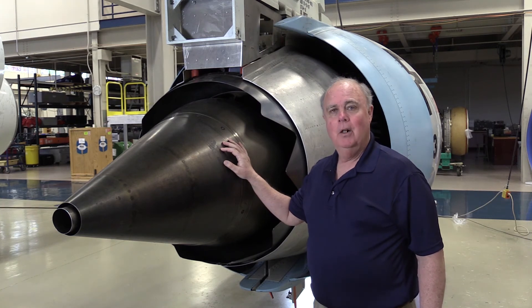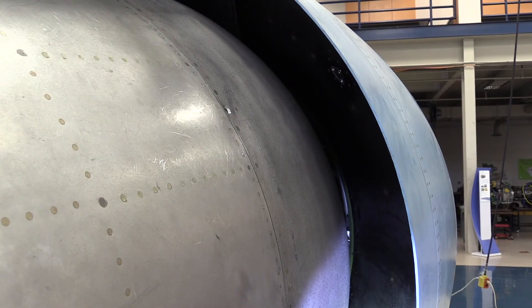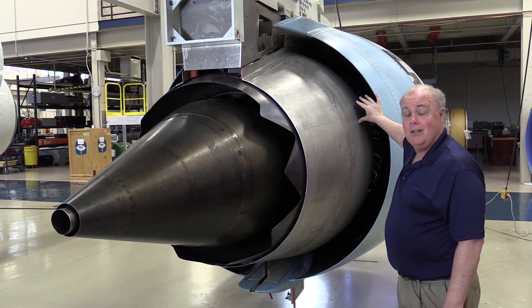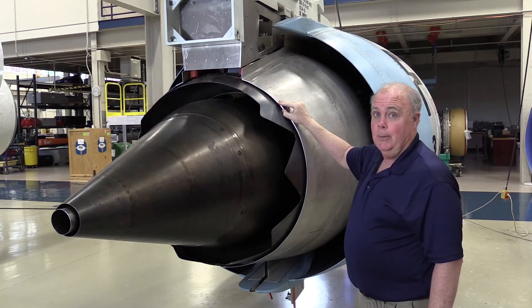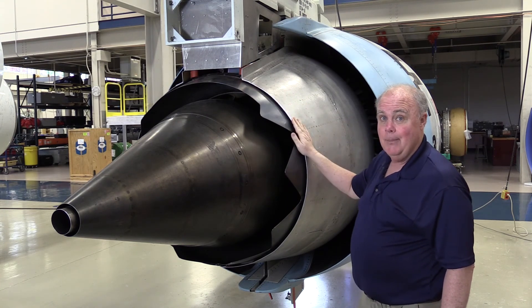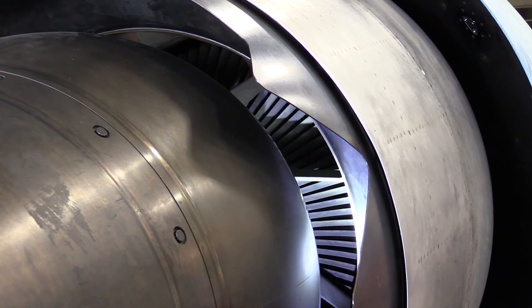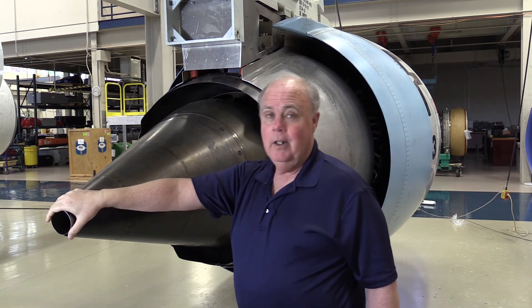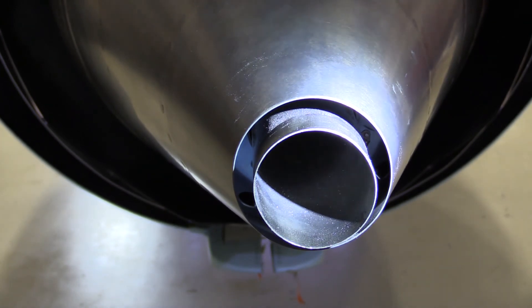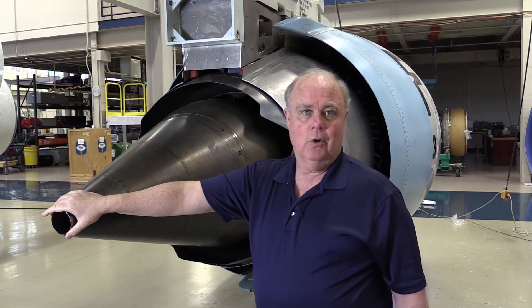Once we cover the engine — which we'll show you in more detail — we're going to go to the aft end and show you how we cover that. Now we're at the aft end of the engine, which is also critical to cover to eliminate the chance of FOD or possible moisture. In this area, you'll see we have the bypass — essentially the same area as the front, where if we get moisture in, we could cause damage to composites or abradables. We have the vent from the core compartment, which is very small. FOD does include possible rodents or insects — this would be a great place for beehives, which has happened in some cases. We also have the actual engine opening going into the LPT area, where if rodents or FOD got in and reached the actual turbine, it could cause serious issues when you start the engine up. Finally, you have the aft vent area, where you could have issues with moisture or rodents getting in, potentially reaching the sump areas and causing damage to bearings and some of the internal workings of the engine.